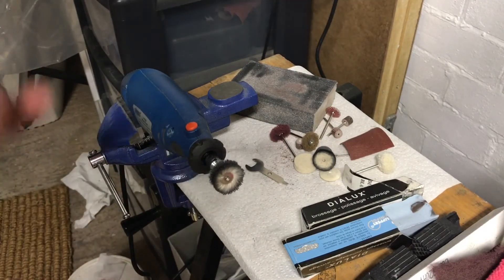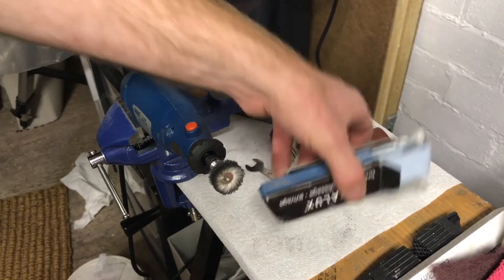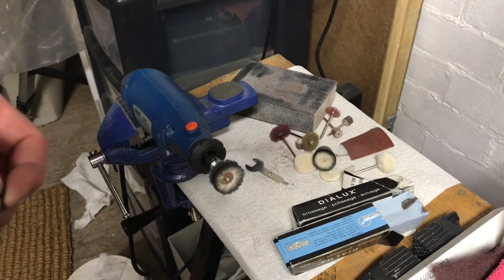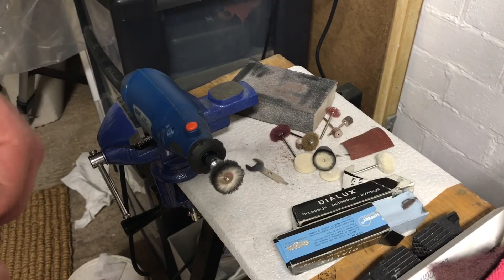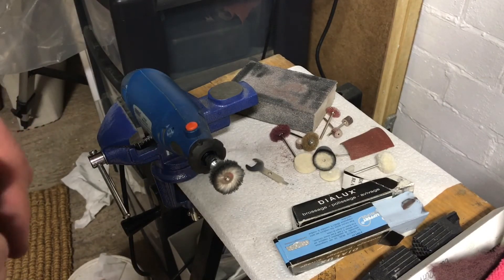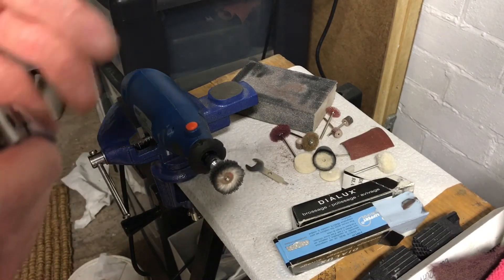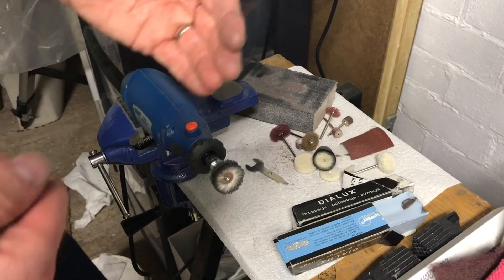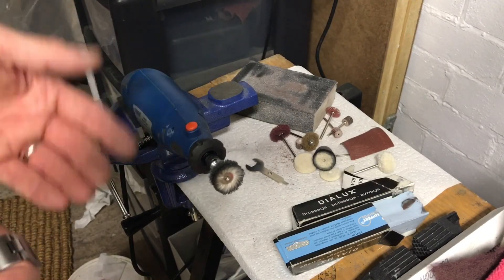Perhaps I'm not using the most professional techniques, but it's how to do it nice and cheaply. This rotary tool costs about 20 pounds in UK money, the compound bars are only two or three pounds each, and the other peripherals are not much at all. If you're into vintage watches like I am, they generally come a little bit worn out and it's nice to have a go — certainly if they're cheap enough. If you want to attempt this, buy one of your cheaper watches and have a go. Anybody can do this; it doesn't take much, just a steady hand and a procedure. Start off rough, go down smoother and smoother — that way you will get the best results.